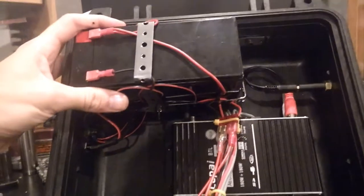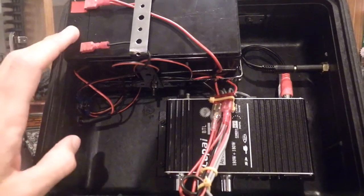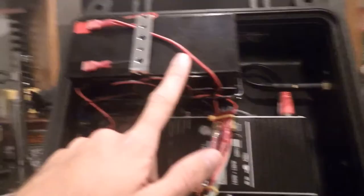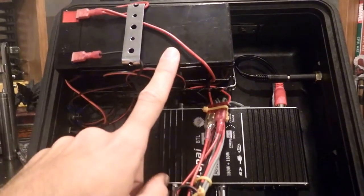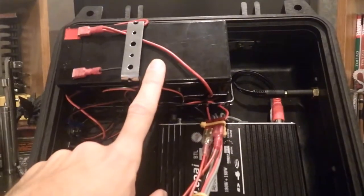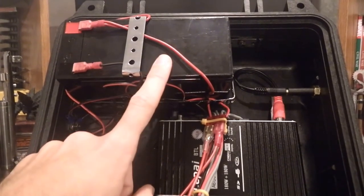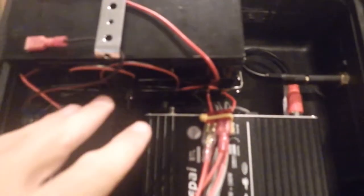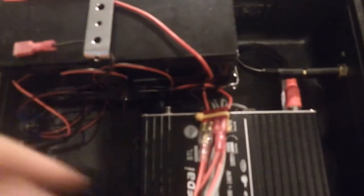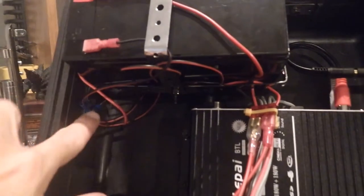You can see the battery — this is why my battery life is so long. This is a 12-volt DC 9 amp-hour battery. It's definitely overkill for this project; I probably should have gone smaller, but it does the job I want it to do and does it fairly well. Let me get into how I've got it all wired up. I know it looks a little messy — this is just all my grounding cables from a couple of different things that I have to bring to a common ground.